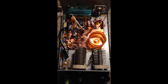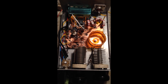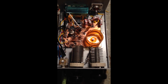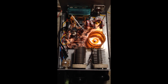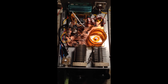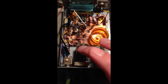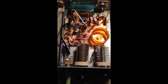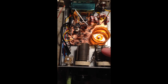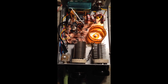I probably didn't need to use the pill bottle coil. I was experimenting with some different toroids, and I'd seen somewhere where somebody claimed that the pill bottle coil had a much better temperature coefficient than other toroids. To be honest, I haven't really noticed a big advantage with that, but it worked well enough and once I got it in there I didn't want to take it out. The main tuning is this variable capacitor from my junk box, and this is a fine tuning capacitor here. The range on the fine tuner is only maybe one or two picofarads.